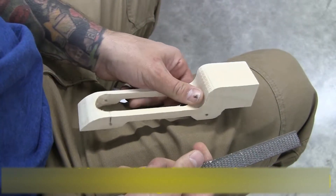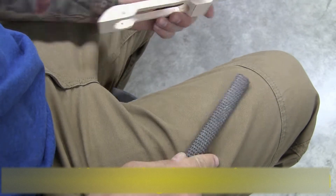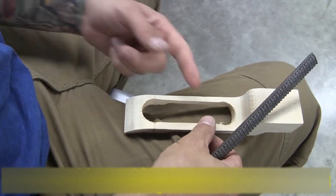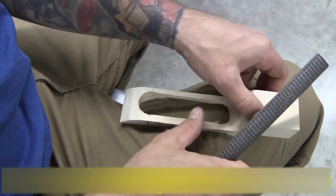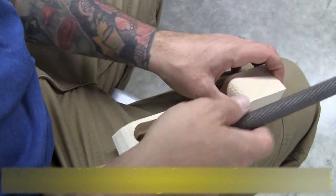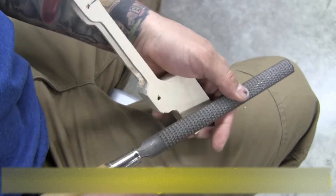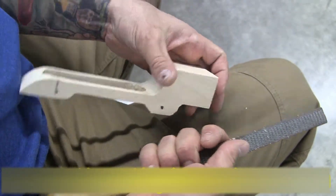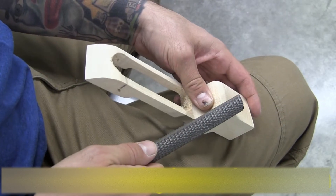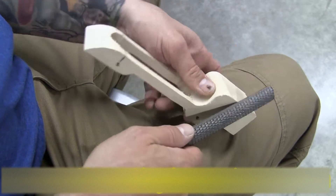The way that I like to do this is to use my thigh to round this out. I like to set my CO2 car so the front is facing towards my belly, with the power plant housing flipped away. My tool here — the wood rasp with the brown handle — I'm using the flat side. I like to choke up on this tool and grab it up here; I have more control that way. I'm going to take this tool and gently rub it across this corner.